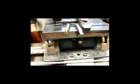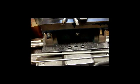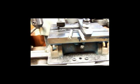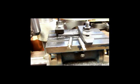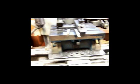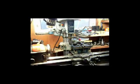Then I can take this mount off. This mount is bolted onto the carriage with those bolts, and I bolted a work piece onto that piece of plate steel — that becomes a clamp-down for any work I'm going to use on the lathe. Then I can take it off when I want to use just the lathe for turning.